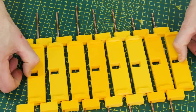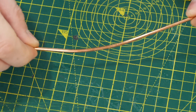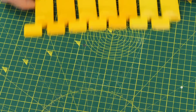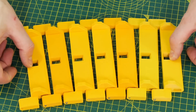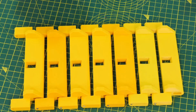There's quite a lot of stretch because those axles are quite bendy — it's cheap steel from an educational supplier that deforms easily. So I'm upgrading to 3mm diameter stainless steel rods. With those cut to the right length it feels a lot better — much stronger, with just a little bend, and it won't deform permanently if stretched.